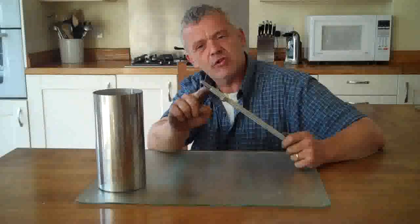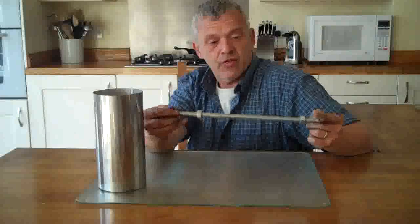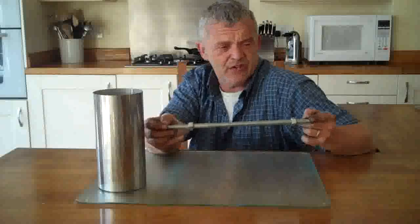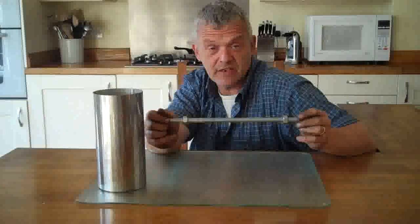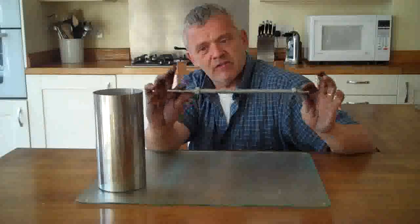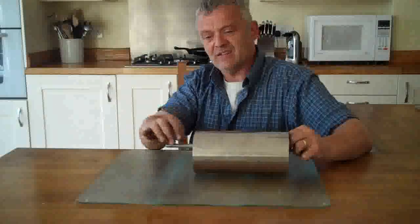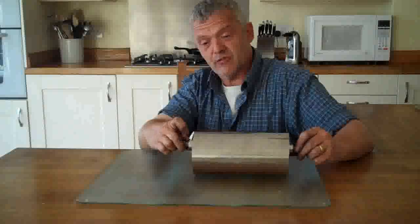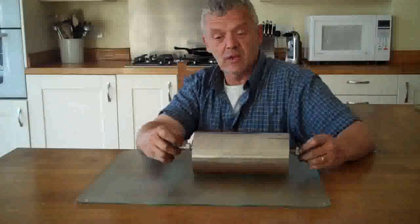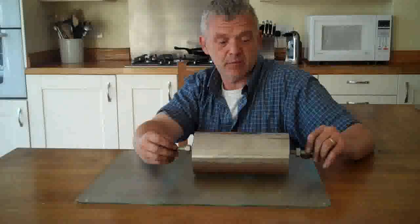I've already done a little bit of work on this - I've turned off the end so that it will go into the drill, and that's the bit that's going to turn it. I've turned the other end and put a centre in it because the cradle I've got has a live centre. I'll put the live centre through there, the drill through there and that will be turned. When I've finished machining, I've put a couple of nuts on it, and those nuts are going to tighten down whatever I use for the plugs at each end. I'll make two plugs, pop them on, tighten those nuts down, and that will make my centre drum.